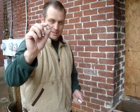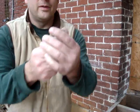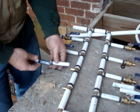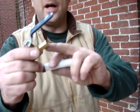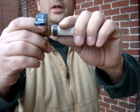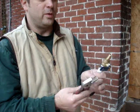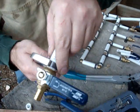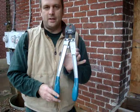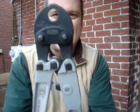The copper compression ring slides over the end of the PEX. Then I put my brass barbed fitting into my PEX — it pops right in — and I slide the ring down. There's about a 1.5 to 2 millimeter space, and I want to hold it in place. Very lightly, without significantly deforming the ring, I take an adjustable plier and put just a tiny amount of pressure — barely squeezed it, just enough to give it some friction. Now I use this PEX tool made by a company called Zurn. This is a compression device that grabs that copper ring and compresses it exactly the right amount on the fitting.